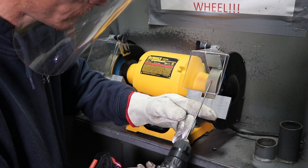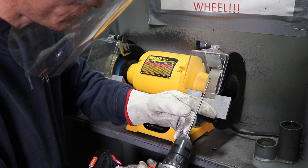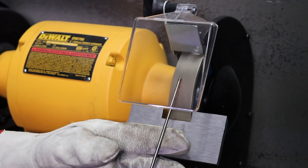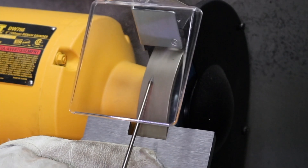As you can see here, I'm lightly guiding the tungsten across the face of the disc, just to wear it out evenly. Notice that I'm spinning the drill at a relatively low RPM. This is so we don't overheat the tungsten — the one thing you don't want to do is get the tungsten so hot that it starts to glow during the sharpening process.